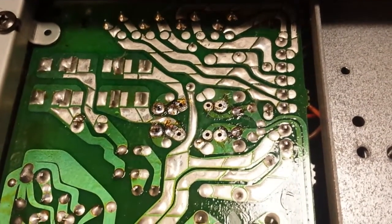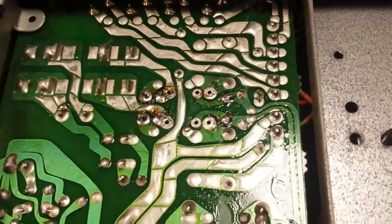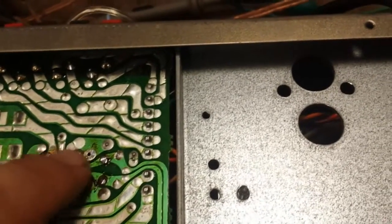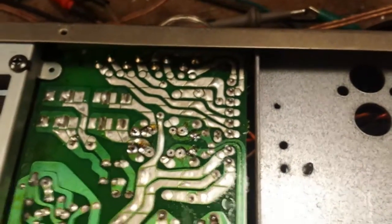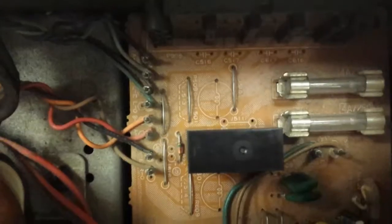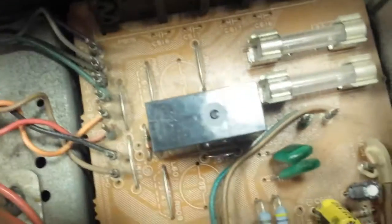The problem was that in my haste I neglected to see that there's supposed to be a jumper between this point and this point. What happened is the input point of the old relay has a solder pad here for a jumper connecting these two points, and it was missing. All I need to do is install the jumper and that will fix it - that's why we weren't getting any sound. Always take a second look. You can see on the top side there are jumpers J511 and J512, so let's put those in.